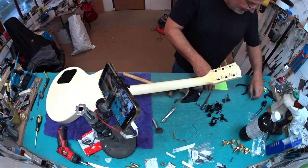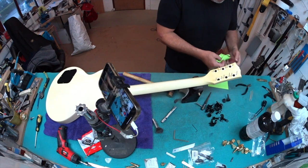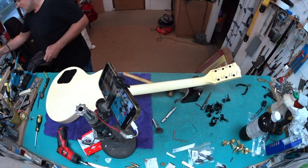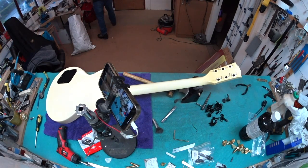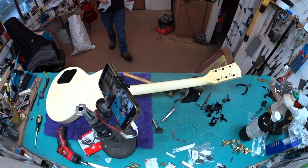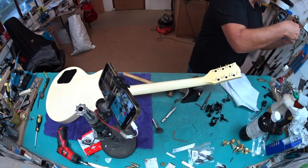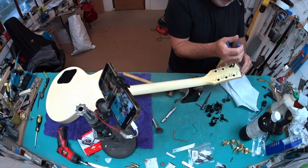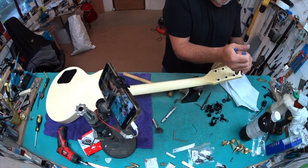So those are my fills. The good thing about the glue, of course, is it's tight bond wood glue, so it's going to stay liquid for ages yet. So I've got plenty of time to go across, get me some kitchen roll, come back, snip off the bits that I don't want, and then I don't have to wait for this glue to dry or anything. I'm just going to throw this on the floor and sweep them up later.